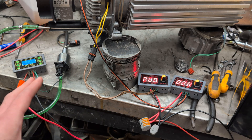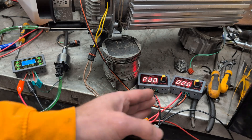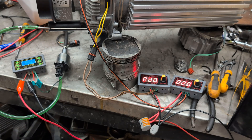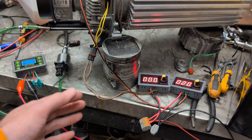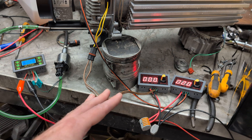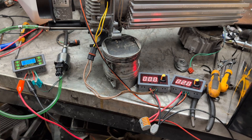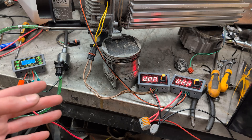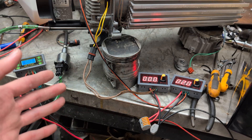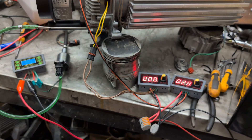So if you were tuning this to run, you would obviously do it in stages. You would pick a fan speed — like 10, 20, 30, 40, 50, 60%. And at each one of those 10% steps, you would use your gauge and tweak the fuel until you've got your 10 to 20 parts per million output of exhaust. Then write those numbers down, because you can use them again later. And then go back down and double check that the same figures work. Obviously once it's up to hot temperature it burns a lot cleaner. Running up from cold probably gives you the best way of doing it. So start low and work your way up — that's how I would do it.